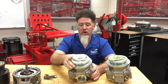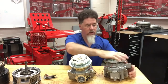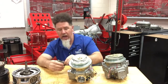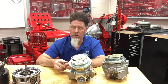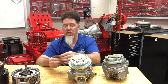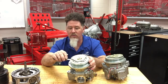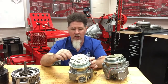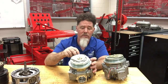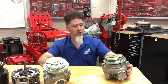This one feels pretty good — moving the pulley feels good, no radial play on the pulley. Let's check our clutch gap with feeler gauges. Normal clutch clearance — I like to start at 20 thousandths. A 20 does fit in there, kind of tight but that's good. So I'm looking at right around 20 — could be 22, could be 25 as a spec. They typically give you a range, possibly down to 18, but I'd consider this pretty good.